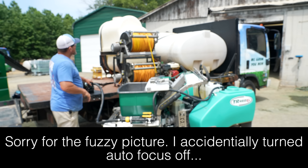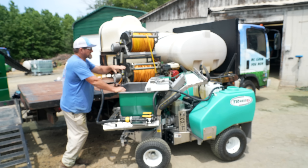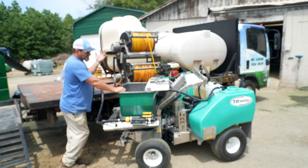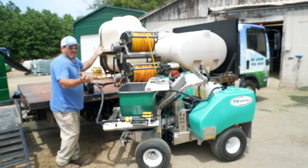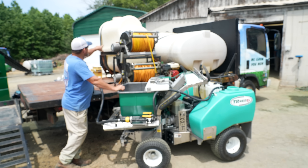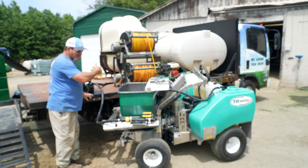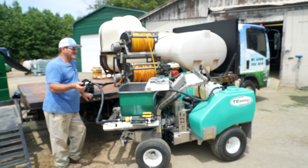You'll have to figure out your tank situation — we use the actual spray tank or back tank on the truck. Productivity-wise, 250 gallons and these are 52-gallon setups, so that's five fill-ups — a good productive day for us. If you don't have a spray system on your truck, just figure out what tank you want to use and plumb into it. We chose to do it this way so we can use the pump and agitation system already in place to agitate the material before loading.